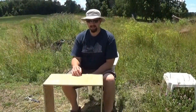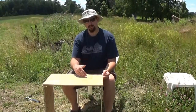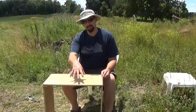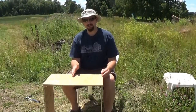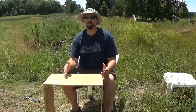I had scrap half-inch plywood around the house — this was a 24-inch wide piece. I cut four 13-inch long pieces, so the box itself is going to be 13 inches high. Two of those sides I cut two inches off of, so the box total is going to be 13 inches high by 24 inches by 22 inches.